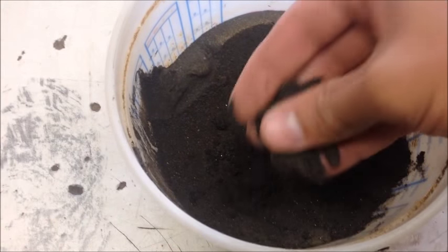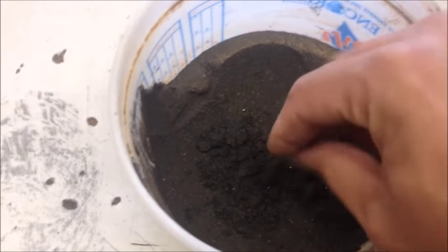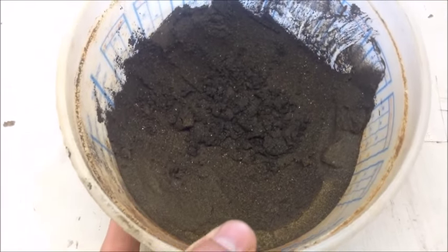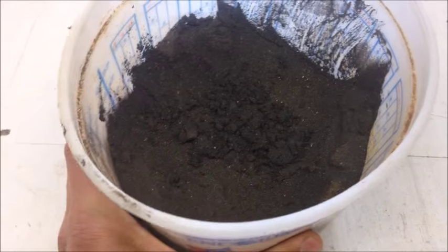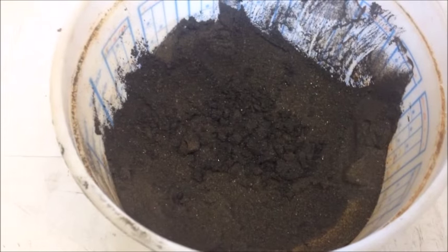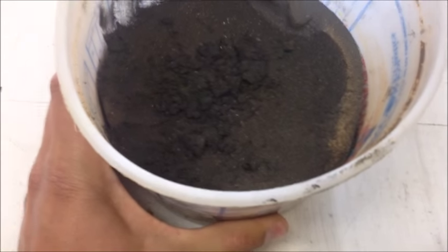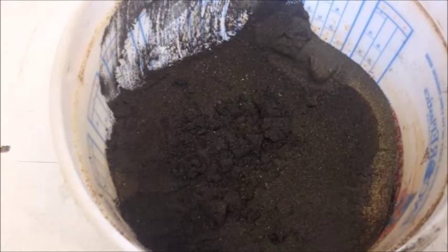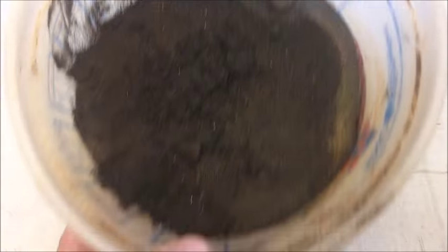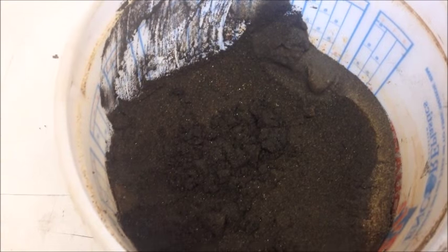Here's some of the high grade concentrates that come off the shaker table — this is the number one and number two port — and I've panned out all the free gold. I'm not going to roast this stuff. The reason I'm doing that is because it's really hard to roast a bunch of material. It's fairly easy to roast about a quarter cup or half a cup, but when you want to do pounds and pounds of material it actually takes a really long time, and you've got to have it all exposed to the oxygen in the air and get it to about 1200 or 1300 degrees Fahrenheit.